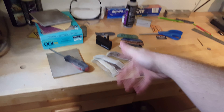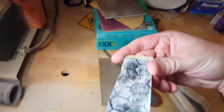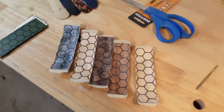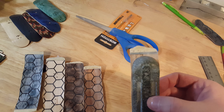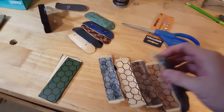That thing is looking sexy as hell. Now I'm going to drill through the rest of the hole. What I like to do is get them squared off so the holes are dead center, so when I put it down flat the drill goes very evenly straight through. Going to drill these all the way through. There we go, got the holes drilled through. Now I'll take my template, put it on the deck, and trace around the nose and tail so I know where to sand.